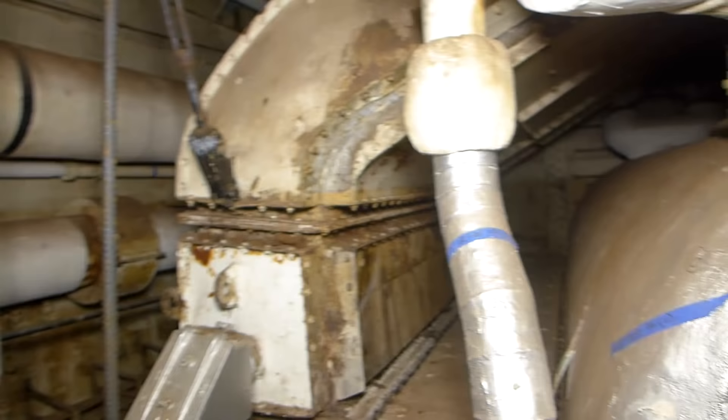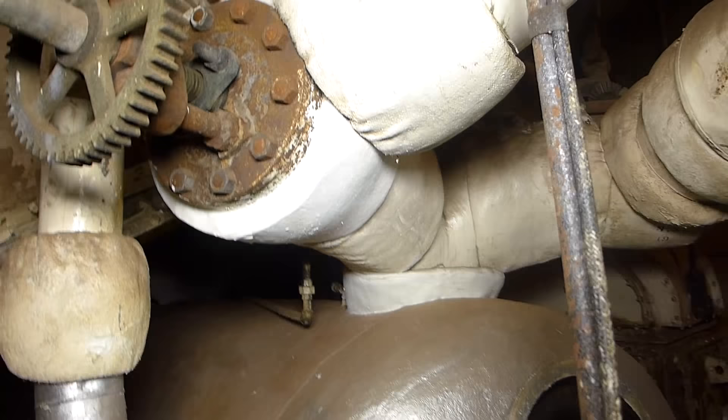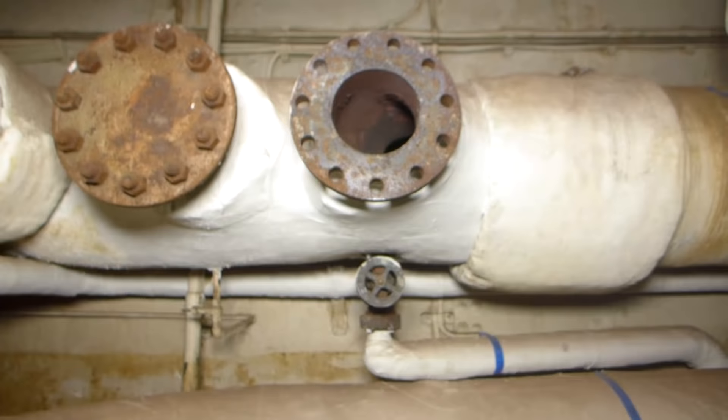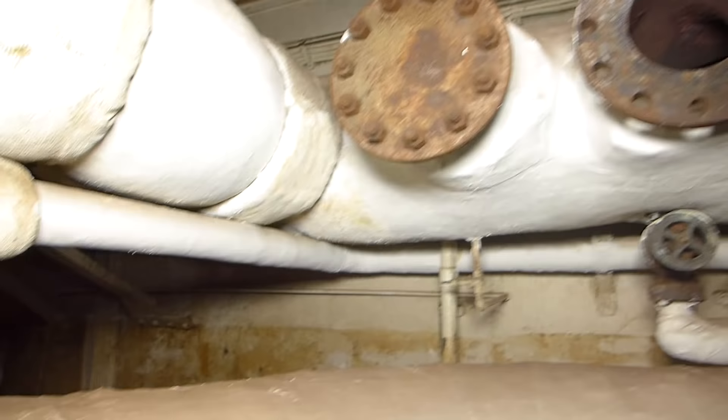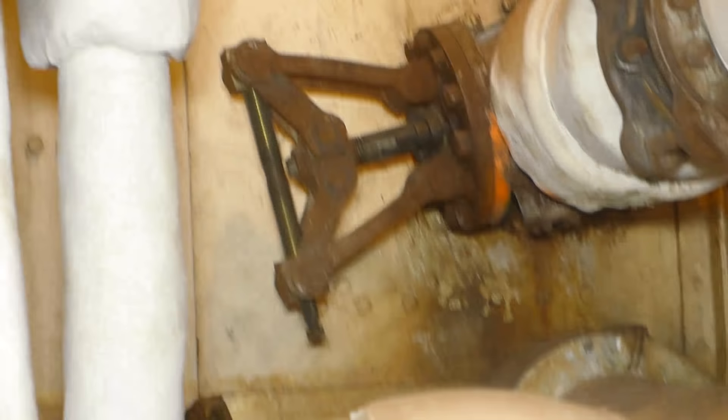I am now on a catwalk at the top of the boiler. From here, we can see the steam drum. Off of that come two steam outputs, and for redundancy, in case there's a valve or pipe failure, they can close one off and feed the other one alone — or both of them — into the steam main, which is this very large pipe at the top. These connect through those cross-connect valves out in the ammo passage. In fact, there's a cut-off valve there that's actuated by that handle or stem shown at the bottom of the ladder room.